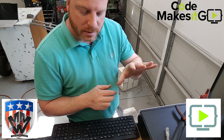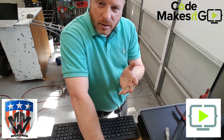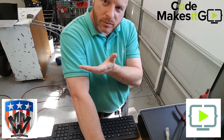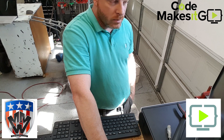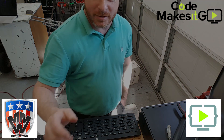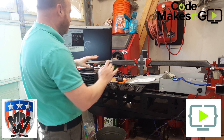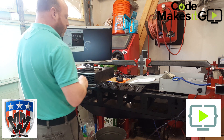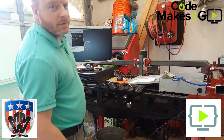Now I'm in the test axis and I'm going to try to jog back and forth and see if it moves. If it does, you should see it move with the axis. I'm going to take you down from there so you can kind of see it — keep your eye on this stepper. The workspace scale isn't set up correctly yet, but you can see it moving. I'm going to call that a success.